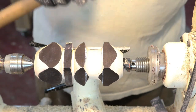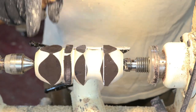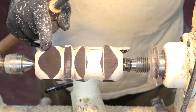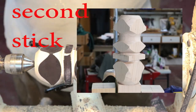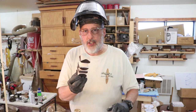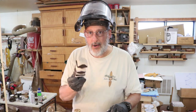So I've got a pattern I can do once a day for a month. That was a lot of fun, and I think I covered every cut you could possibly make: a straight cut, turned that into a cove and a bead, a lamb's tongue, a round over, a parting tool cut directly into the wood. Thank you very much for watching. That was a fun project — a little practice never hurt anybody. The challenge would be the next one: maybe measure so you're duplicating it a little bit. But eventually you'll want to do this without measuring and marking, and make an exact copy. That may take a few days. Thanks for watching — I'll talk to you later.